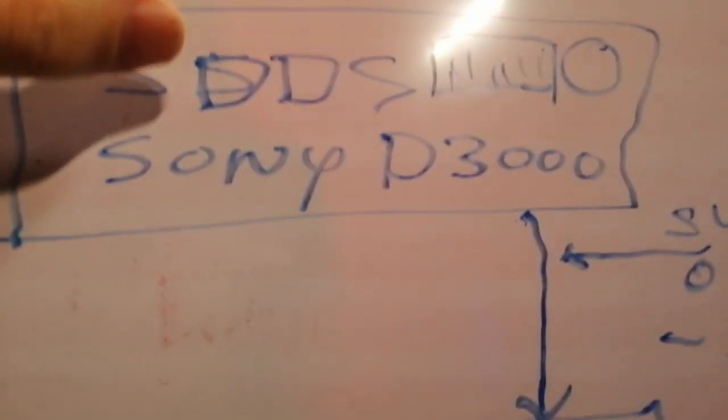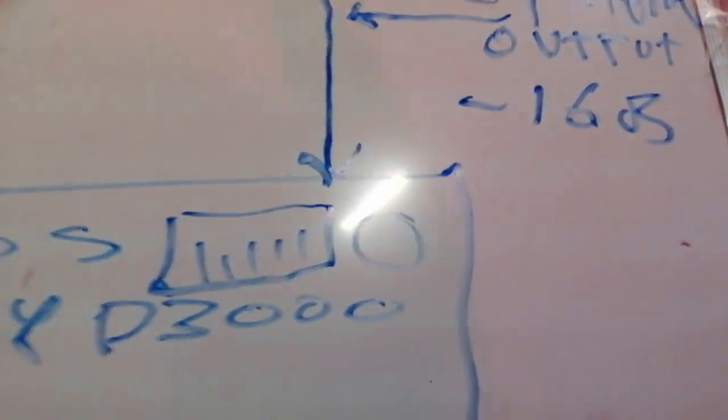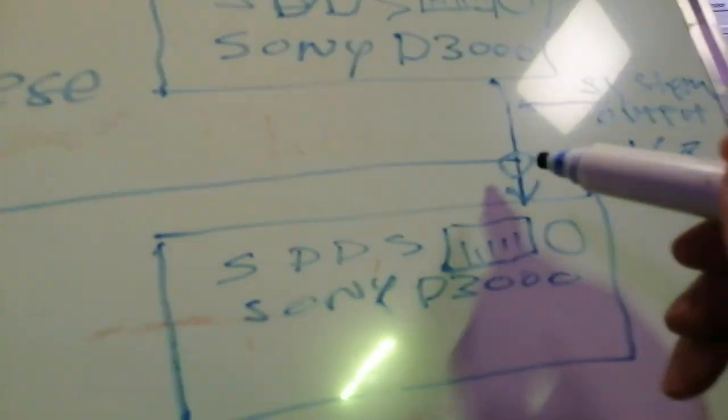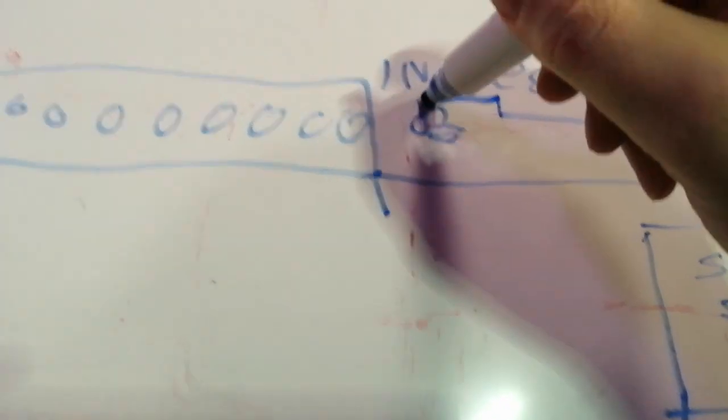That's the main SDDS — the main primary SDDS — and it's coming down on the system output. The output's at minus 16, so by the time the signal gets down to here, of course it's going to look imbalanced in level because it's at minus 16. So I would wire the Behringer box in so the signal is coming out going over and around.